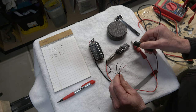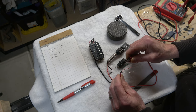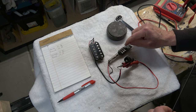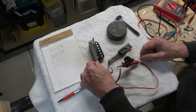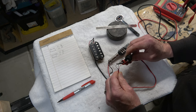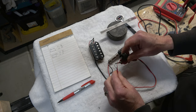I'll test these wires the same way I did with the multimeter, but with this tool I think you'll find it's easier to understand the results than watching numbers on the multimeter screen. I connect the red wire to the black wire, then connect the black wire to the green wire first. Neither LED is lit, so I tap the pole pieces with ferrous metal — no signal on either coil. Obviously the green wire doesn't go with the black wire. So I connect the black clip to the red wire and do the same thing — no signal on either coil. The red wire doesn't go with the black wire.